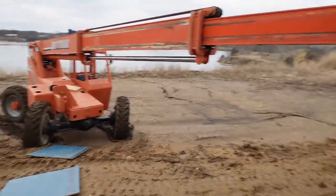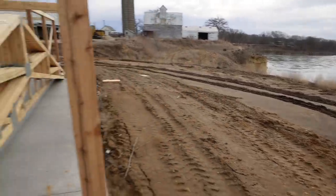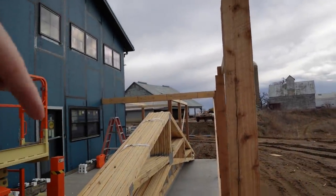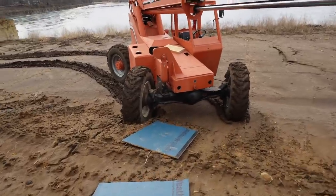The telehandler has a load of lumber — that's mainly our purlin material. We don't want to lift all these trusses by hand, so we want to get that telly as close as possible, put the boom up, and pick each truss up one at a time to lift them into place. It's going to be 50 degrees today, 57 tomorrow, and then it'll freeze back up — which is good because by then we should be done with all our framing on this porch. Then we need to get the scissor lift out and run our sheathing. I don't want to work out of the mud because it just makes a mess around the job site.